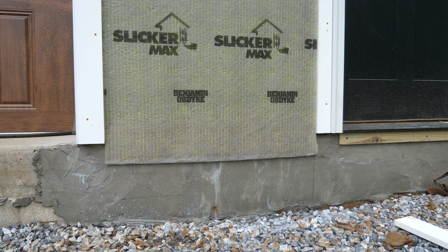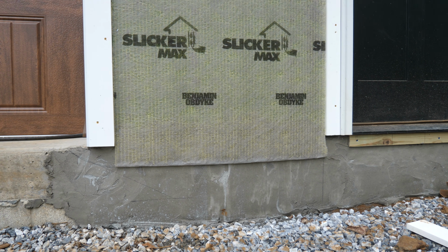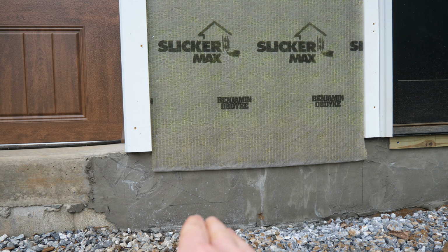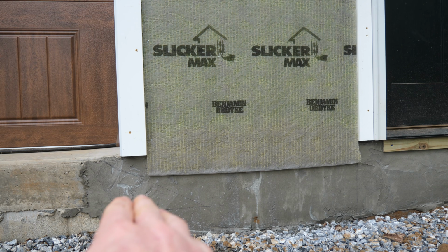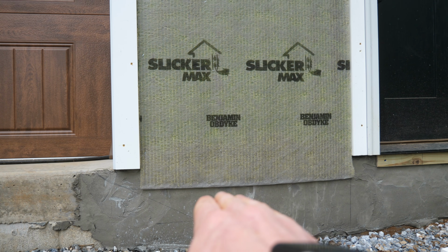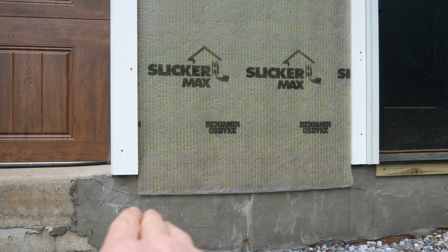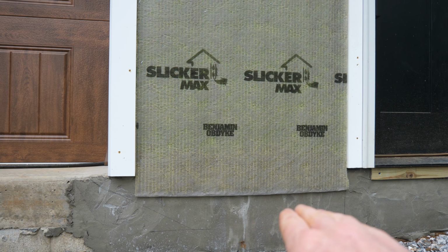The wall up here is going to be a little different because we have a garage door next to other doors. So I don't really want the grade to pitch down as much as I had it drawn there. I don't think that's going to look good. So we brought the bottom of the weep screed up here about 6 inches higher, and that will allow us a gradual transition. That will be the grade level.